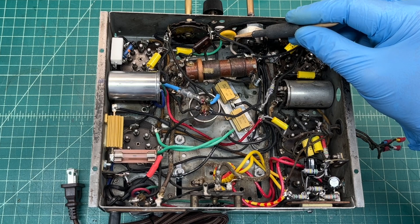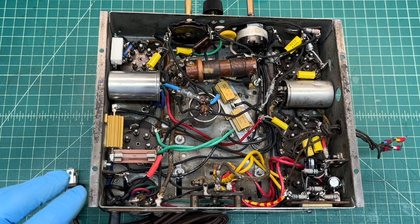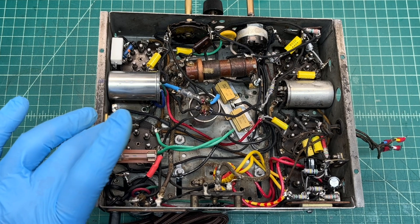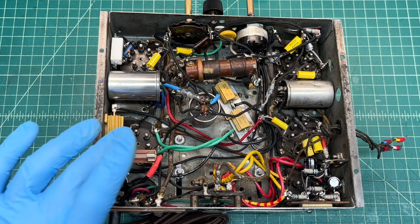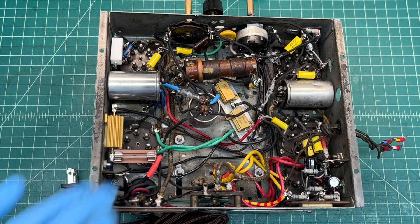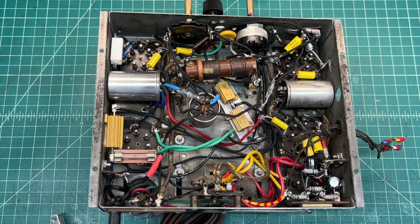There's a safety cap over here by the on/off switch. To get the voltages where they need to be, I have a 45-ohm power resistor located here on the chassis with the fuse — it will waste a little energy but it does the job. There's a UL knot for the new line cord, and I think we're in pretty good shape.